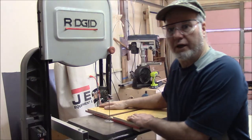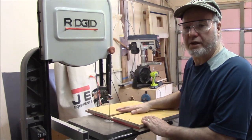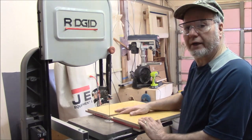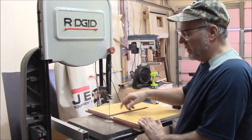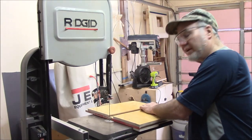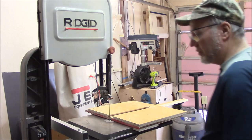I have my circle cutting jig set up on my band saw. If you didn't see the details on this jig, you can see my video about making a round wall clock — I used it and explained it in there. I'll put a link in the description. I'm ready to cut. It'll be slightly under a 24-inch circle — I've got it set at about 11 and 7/8 inch radius. So now we'll cut all six of the shelves.